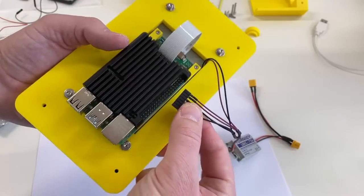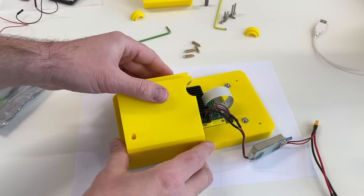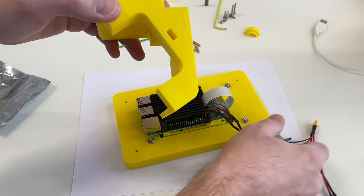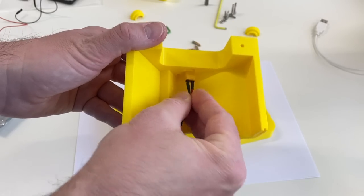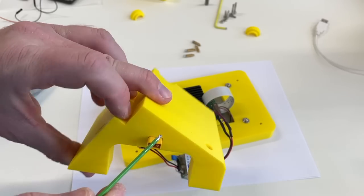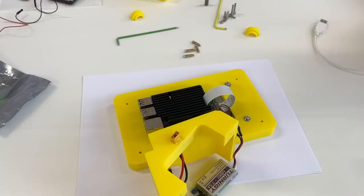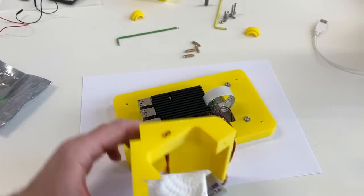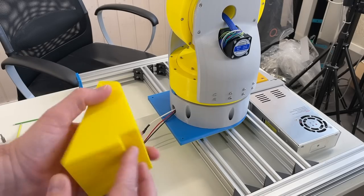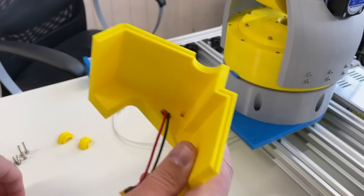This connector is going to power our Raspberry Pi — it goes over here like this. Now this piece goes here, this one goes on the other side, but on this piece there is a hole for the connector, so the connector goes inside and should be glued in over here. I'm going to put a little bit of glue here, here, and here and push the connector inside. This piece with this one should be installed over here with M4 screws, and the embedded nuts should be installed from the inside.